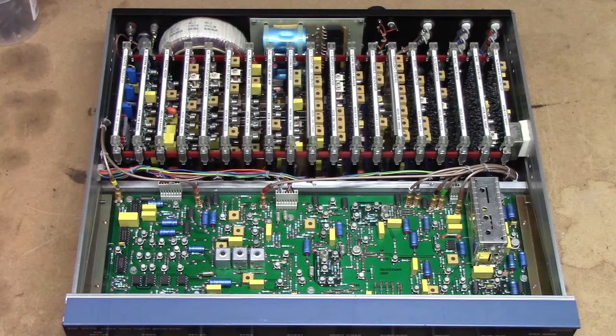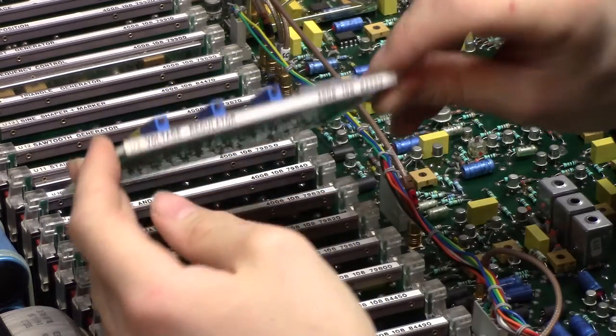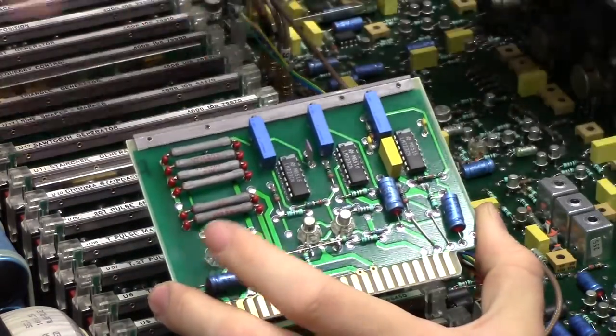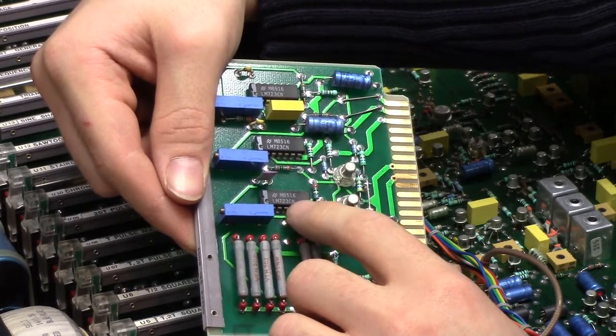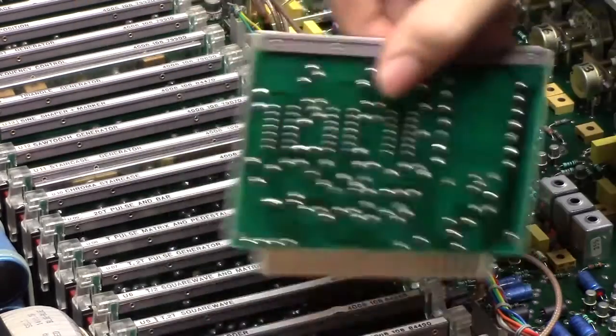After spending about an hour playing Philips' assembly line, we've finally returned to something which looks a bit more like sense. We've got this really heavy duty cast aluminium mounting kit and then the chassis of the unit itself, which is certainly a lot more accessible than before. So we can at least take all the boards out and have a quick look at them. This is the voltage regulator — we've got three trimmers probably corresponding to our three transistors around the back, and three LM723s — pretty classic linear regulators.